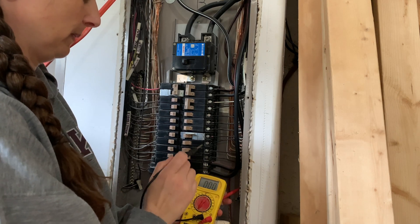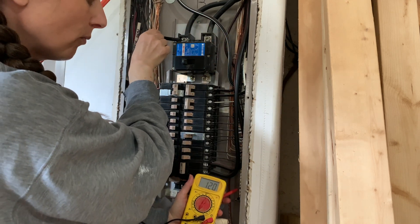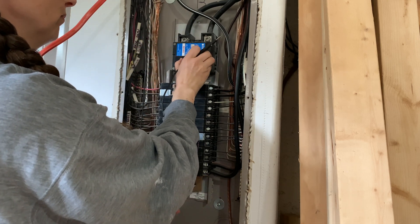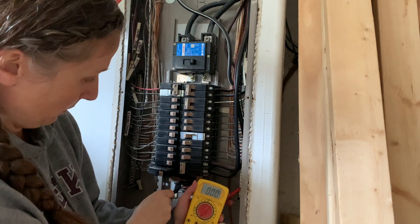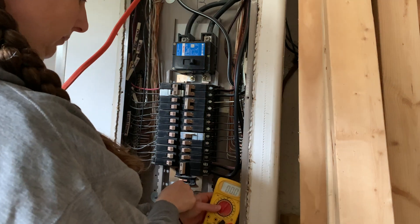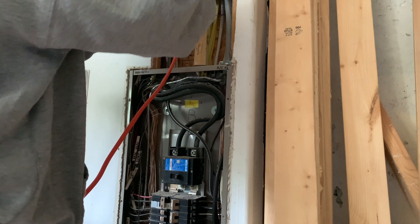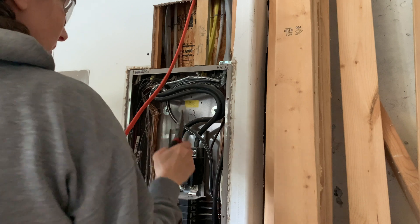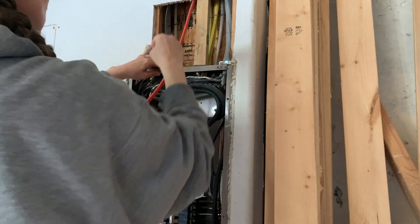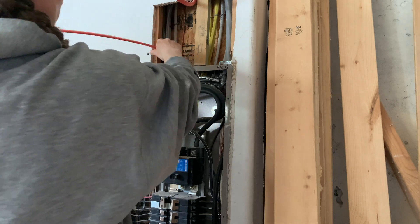Next we'll head over to the main electrical box and install our breaker. At the main box, I'm showing that each of the main wires that come in are 120V. Then I'll test the bus bar to make sure that once I turn the electricity off, there's no longer power coming to the section I'm going to be working in. Remember that the box is still technically hot near those main wires, so you want to be careful. I'll dislodge a single knockout from the top, then use a half-inch cable connector inserted in the knockout slot and push the wire through. This will prevent the wire from moving backward and secure it to the box.